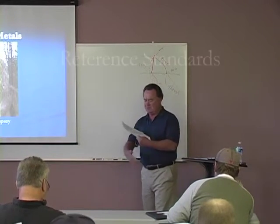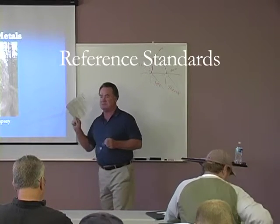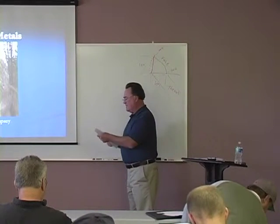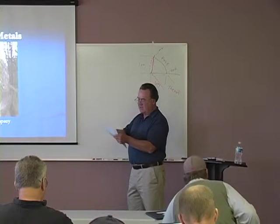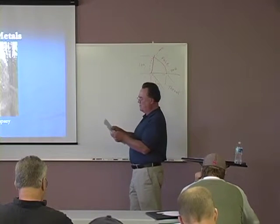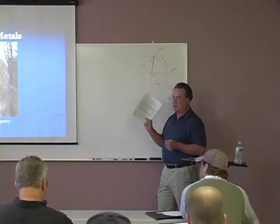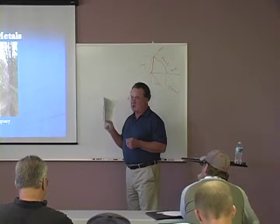Under general information, go to the reference standards section. What I've done here is connect the dots. If a welding contractor thinks he does not have to follow AWS guidelines, this proves him wrong. Our specification in section 440-7 states that welds called for on the plans must be done properly, and at the bottom of the paragraph it states: weld all structural steel in the shop or in the field for bridges in accordance with the bridge welding code.